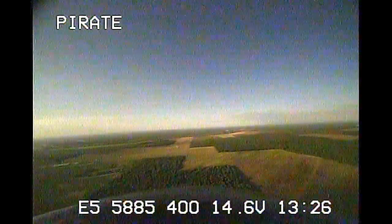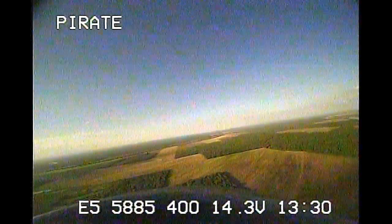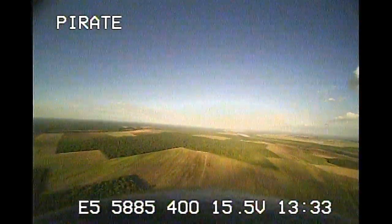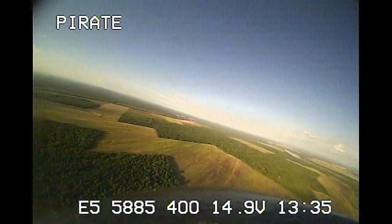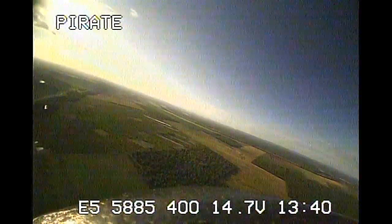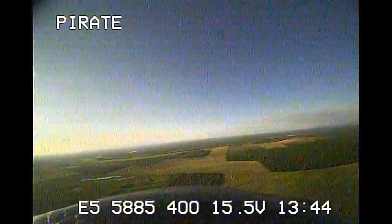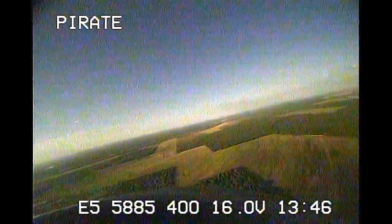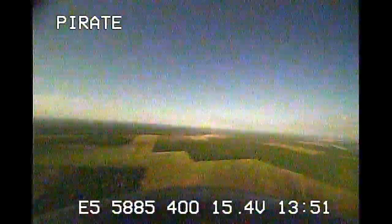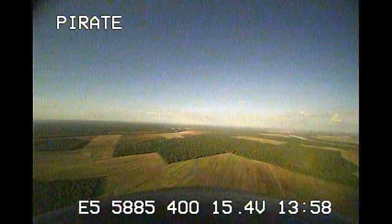My video did get a little more grainy, a little noisier. I've got the circular transmitter antenna option — there is one with a linear dipole, but I got the circular option, and my receive antennas are also circular. You shouldn't really see much effect from banking and rolling with circular antennas, but maybe it's just a directional thing. I think the skew planar wheel four-element antennas do have some small nulls in the radiation pattern — that might be what we're seeing.